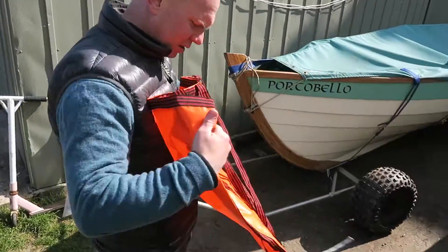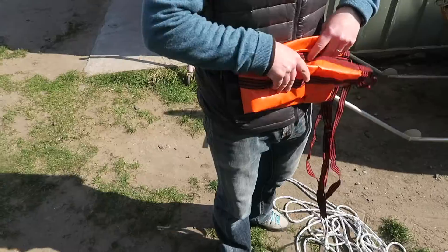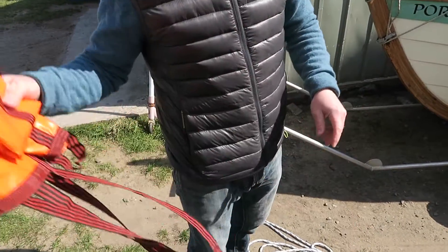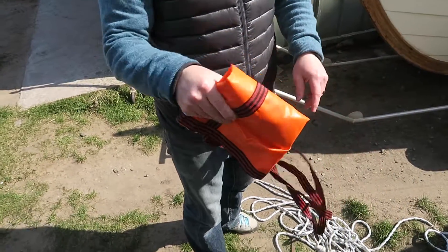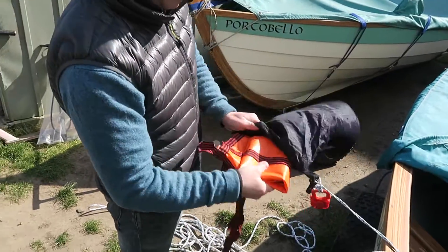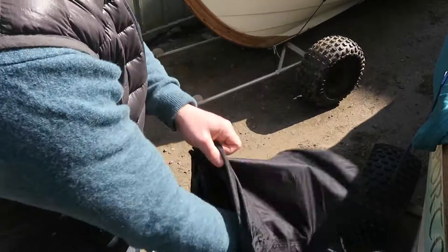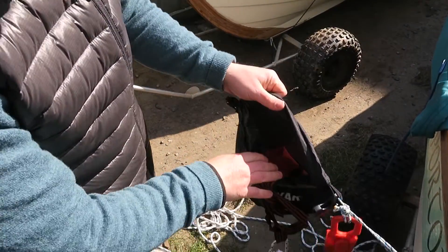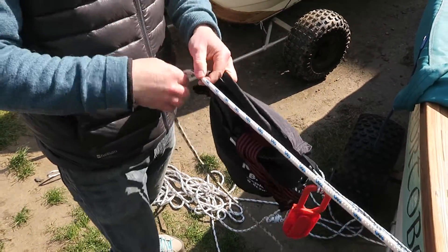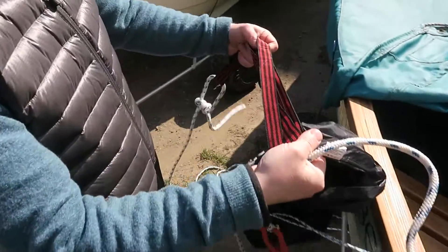We need to get the drogue and fold it back up neatly. The drogue is the first thing that's going to come out of the bag when it's actually deployed. The rope needs to pay out, so theoretically the drogue would be the last thing into the bag, but you can just put it in first to make sure that it will fit, and it will help stow the rest of the rope a little bit more neatly. But then when you pack, you need to start at the boat end. So this is the boat end - that's the drogue end with the red tape on it.